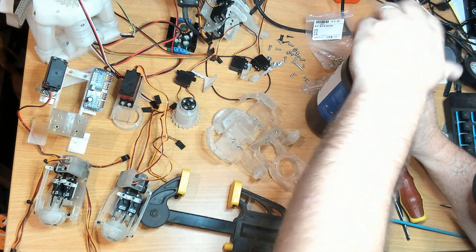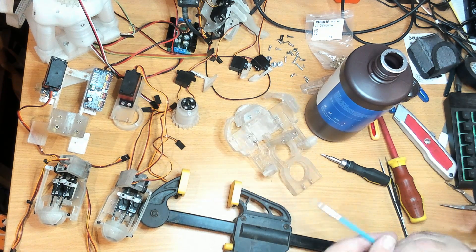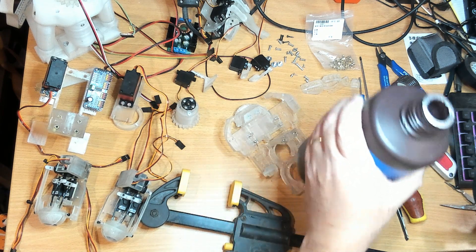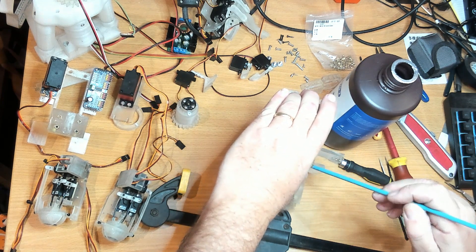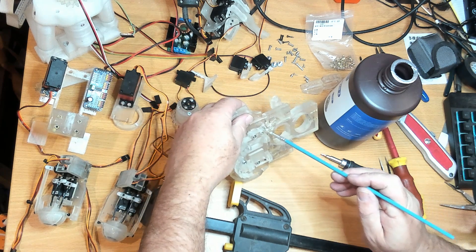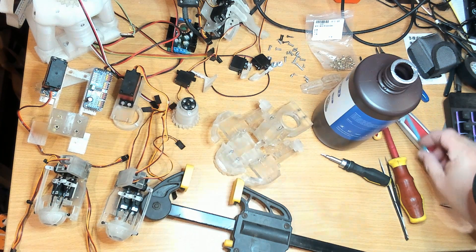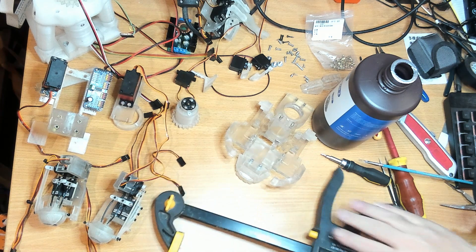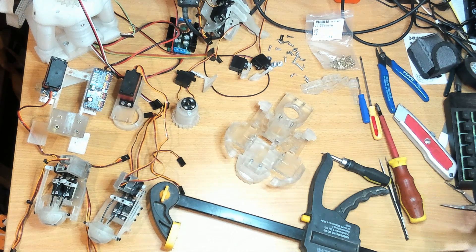Because my UV cure station isn't big enough to hold all of this, I do have a UV floodlight and I did do a review on that a while back. Now I should be wearing gloves. So we paint this all through where the crack is, making sure I've got it on the bottom as well. I might just get rid of this first to give myself some more room — I have to before I bring the floodlight in anyway.